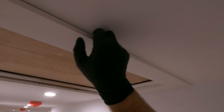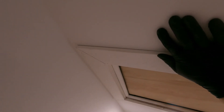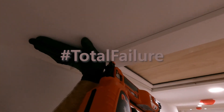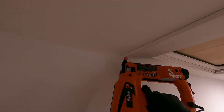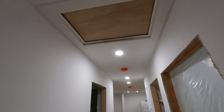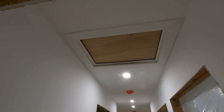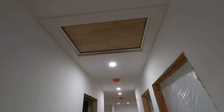What I'm doing here to try to clean this edge up a little bit is bringing my nails in — I'm more likely to hit some lumber — and angling them in too. I'll push this up, bring the nail in, angle it in, and I'm more likely to get some structure. That's going to have to do. It will get caulked around the outside and I'll be coming along to spackle these holes, but that is one of the other ways I know how to put trim up. I don't like it very much, but it makes for some content.